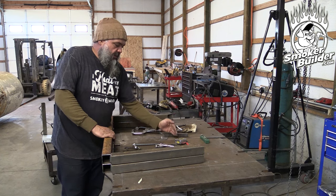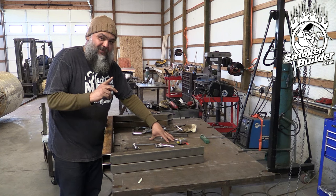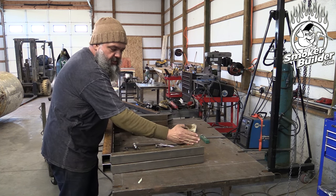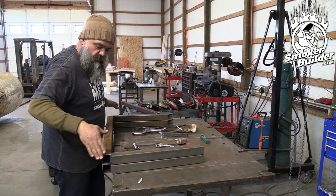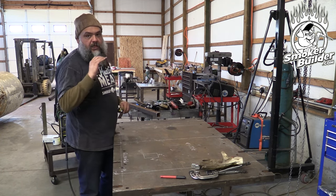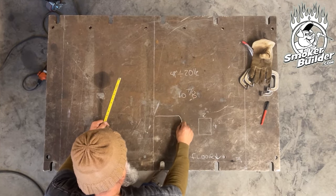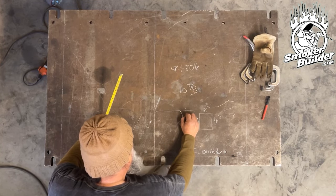We'll come here and make that mark on our layout table that's still living on our work table. Be careful not to wipe off your notes as you're building something. Then we'll be able to go right to our same location where we just fab these legs, find that difference, and transfer that same line right to our new length. The difference between the top of the cook chamber and the top of the firebox is 10 and 7 eighths. So we have our cook chamber here — it comes turned down — and then our firebox starts and lives there. This is the measurement we're looking for right here.